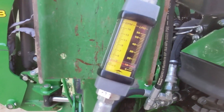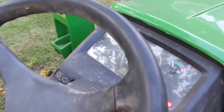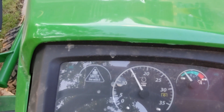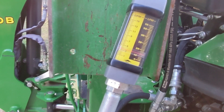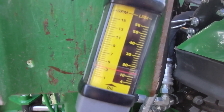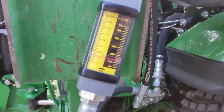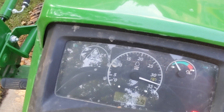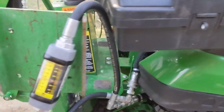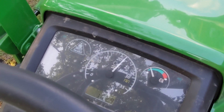Just take a look and see what we're getting — two and a half, a little over two and a half, so 2.6 to 2.7 maybe. Let's jump up here to factory idle. Based on how I have it tuned, factory idle is actually going to be three and a half gallons per minute, so this would be where I'll set it for the factory test. Just under eight — not at eight I would say — and 3350 to 3400 RPMs.